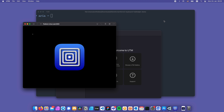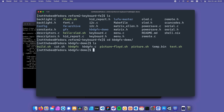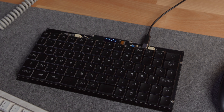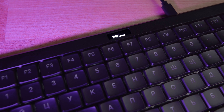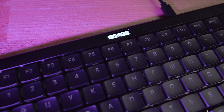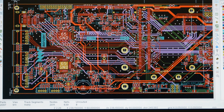As far as I know, this functionality is only supported on Linux, so let me fire up a virtual machine and show you how it works. We have a folder called kbd-gfx-demo, which contains some scripts to work with the built-in display. We first execute build.sh, then run ./kbd-gfx.sh /dev/hidraw3 — and on the keyboard we should see a sine wave animation. There are a few more scripts: text.sh lets you display any text on the screen, while picture and picture-floyd let you display a custom image. Keep in mind it's a monochrome display with a resolution of 128x32, so don't expect to run Doom on it. You can use it to display stats, email or messenger notifications, the current price of Bitcoin, or even the subscriber count of your favorite YouTube channel. Since both firmware and hardware are completely open source, the only limit is your imagination.